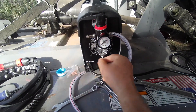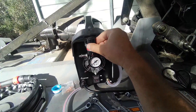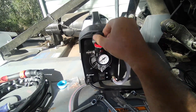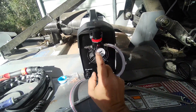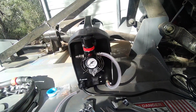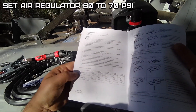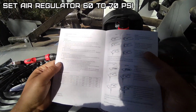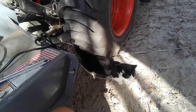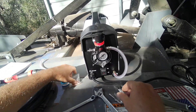Not only is that a regulator, it has a little water separator here to drain the water out, and when you release the pressure it'll automatically drain the water. You also have to pop this top up to adjust it, then push it down to lock your setting. I'll get it set once I get the air compressor hose hooked up. They say 60 to 70 pounds for pretty much every thickness and setting, so we'll set it to 65.